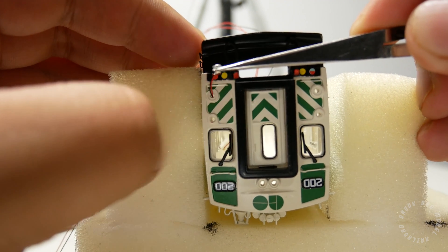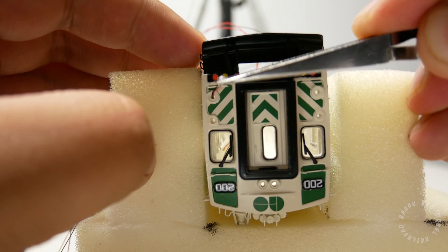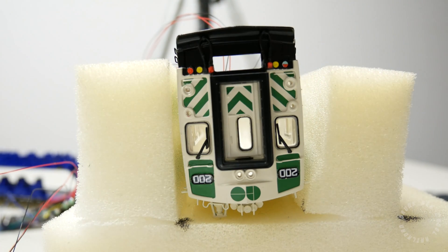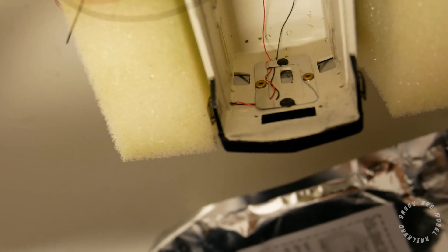You need really steady hands and a lot of patience for this part. I recommend using a head-mounted magnifying device to help you avoid eye strain. When the lens is firmly glued onto the LED, pull the wires back and push the lens back into the hole of the shell. If your LED was dead center, then it should go back in fairly easily. Push the lens all the way in with your finger and then brush some Aleen's tacky glue on the inside of the shell where the LED is. I use the tacky glue because it's easy to remove in the future if one of the LEDs burns out, compared to cyanoacrylic glue which is almost permanent once it's set.